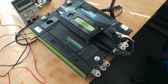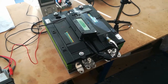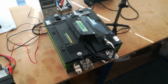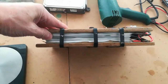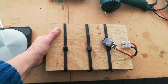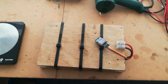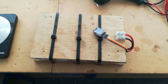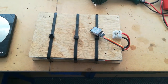I could have used LTO as well, but I didn't really want to hack apart a perfectly good LTO pack — I might need a spare, especially with the UK bulk purchase if one turns out to be bad. So, repurposing the old A123 pouch cells: this is my 2.5 kilo lead acid battery substitute — 20 ampere hours, probably about 15 or 16 ampere hours of useful capacity now. I can't remember what a standard lead acid battery weighs, but it's probably a damn sight more than two and a half kilos.